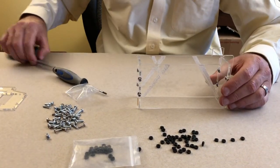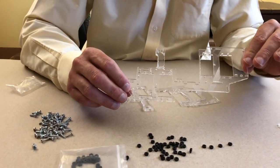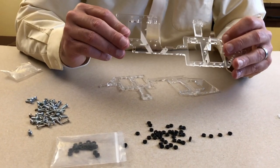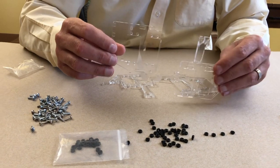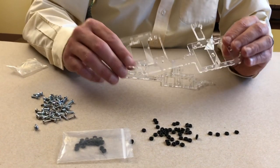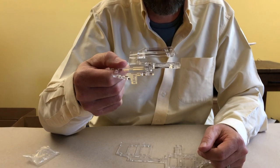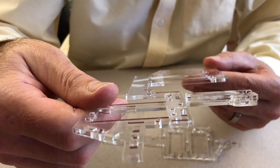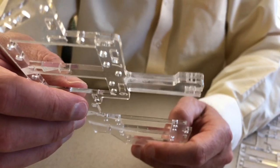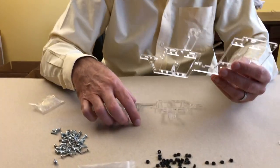Now we're going to move on to the main body. The main body comes in two sides, and this also has etching on it — the etching should go on the outside. An easy way to remember is it's also got these little numbers, so if I face the camera these numbers should be readable on the outside of the robot. The two sides are symmetrical so they fit together. Before you start assembling, you'll want to glue this extra little piece here — it's an extra layer that you glue on top to make that spot a little thicker. You can use whatever glue you like for acrylic; I tend to use a two-part plastic glue.